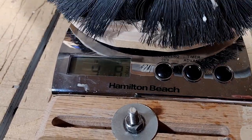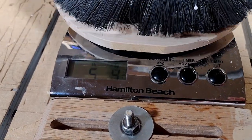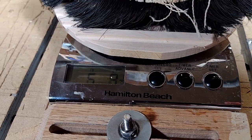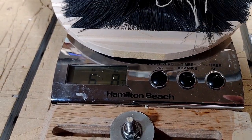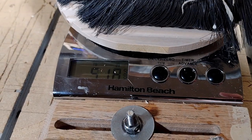After some time to reflect on the results, I'm imagining someone with a 10-pound bag of flour arbitrarily pressing down and then not pressing down on my spindle. I think 10 pounds of force would cause a fraction of an inch change and cause those tooling lines. So in the end, I think this dust shoe is really the culprit on why I'm getting such bad results.